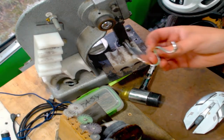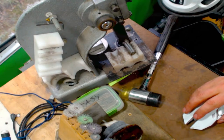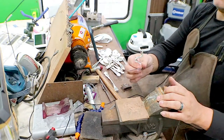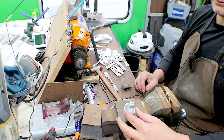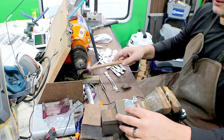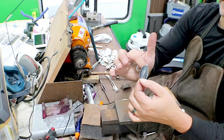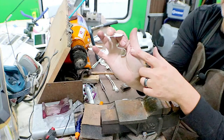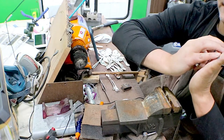Yeah. So I'm making bud vases today. Flip the camera here. So after I get this bent, that's the button. We'll get that out of the way. So after I get it bent, I put it on my anvil, and I want this to sit flat. That's exactly what I want it to do. I'd like for it to not have that wiggle. And then after I do this step, I put my finger in here and I put the handle piece in here and I'm squishing this piece. So I'm bringing it up.